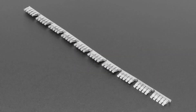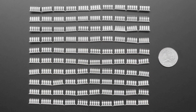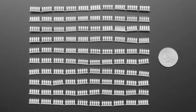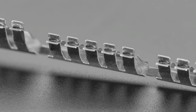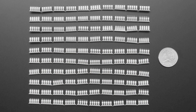This is a bit unusual, but we had a request for it and it was easy to make this person happy. These are the inner clips of solderless breadboards. People make DIY breadboards with them. You get 10 strips; each strip has 10 segments, and each segment has five contacts — 500 total contacts per order for only a couple bucks. Note they're steel, so you can't solder to them. Maybe they're for little custom breadboard areas on a toy or product. You'll have to have a spot that these clip into, but maybe somebody will do something interesting.